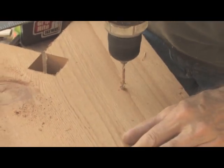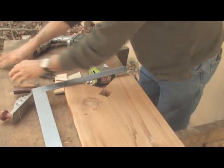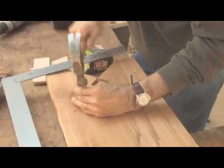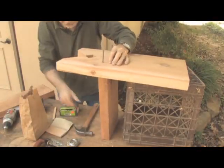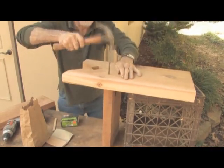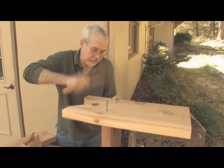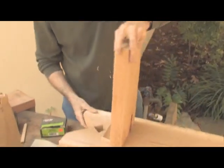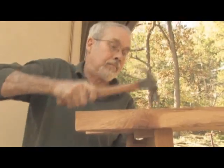Carefully measure and mark the locations for the pole barn nails to attach the sides of the shelf, then drill the holes for the nails. Use a drill bit slightly smaller than the diameter of the nails and drill all the way so the drill bit emerges on the other side — this provides a pilot hole so the nails will go in much more easily. Prop the side up so it's easy to hold the shelf in position while nailing. A crate or cardboard box will do. Be careful that the shelf is tight to the support and equally spaced from the edges of the side, then turn the parts over and follow the same procedure for nailing the other side in place.